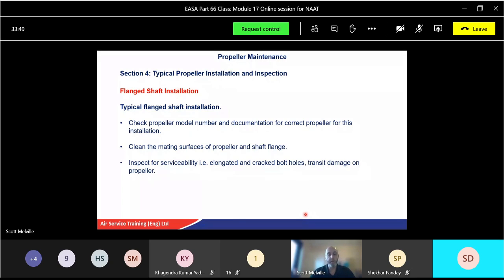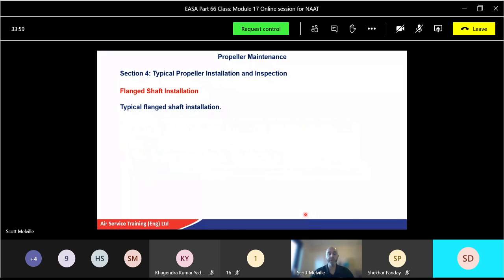We get brand new assemblies, components that come in a box. The box might have been dropped, and poor handling by somebody, unfortunately, it can damage it. We have had that before on various types of aircraft. So don't just assume it's in a box. Take it out, go and fit it. It could potentially be damaged. Hopefully not. So examine the flange for cracks, thread damage.